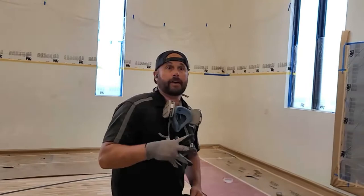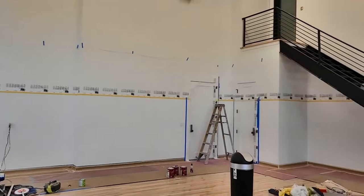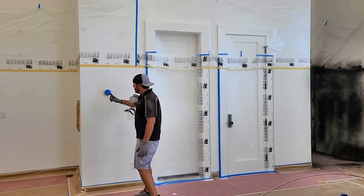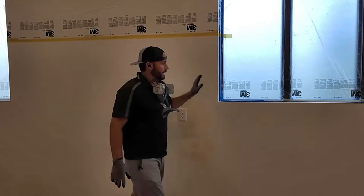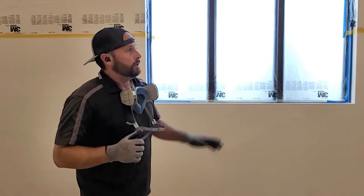Quite a bear, because that frog tape did not want to stick on these painted walls. And they had been sanded, so anywhere in the corner we had sagging on, it took us a little bit longer. But we're here to our moment of truth. We got our laser line, and we're gonna drop our sticky coat right now. A major reason being, as you can see, around all these outlets, all of these patches that have been done. So the two reasons we're doing this sticky coat is to get over all this hot mud and all of the patches. If you come from this area, you see there's patches everywhere. Plus, we're gonna do an onyx black on this. So we're just gonna do a sticky coat, get everything coated, turn it black, and make this thing beautiful. All right?